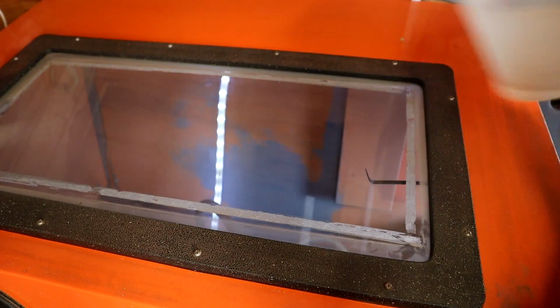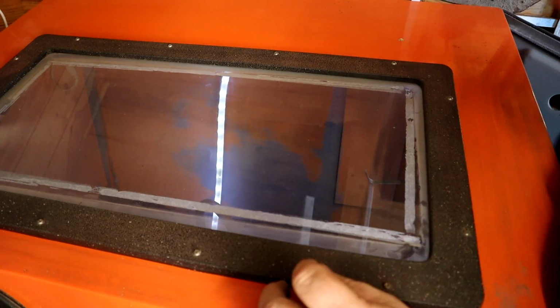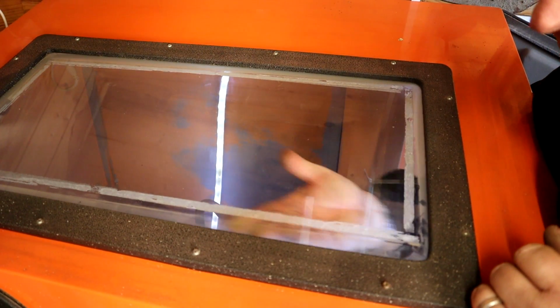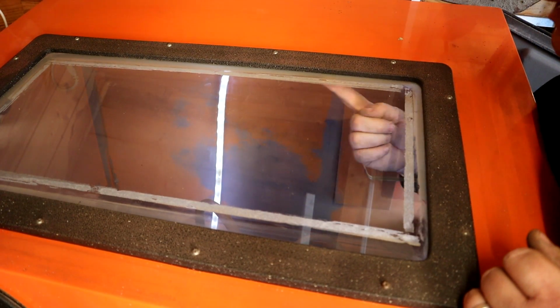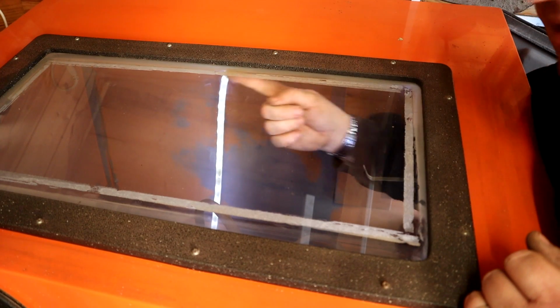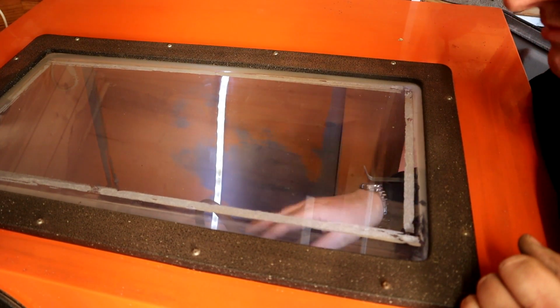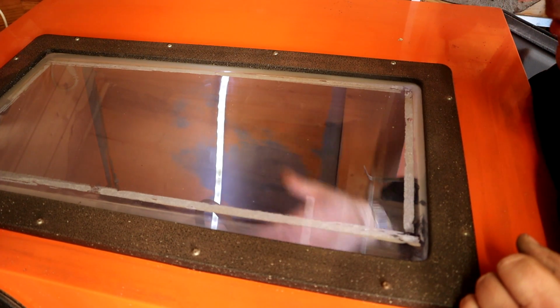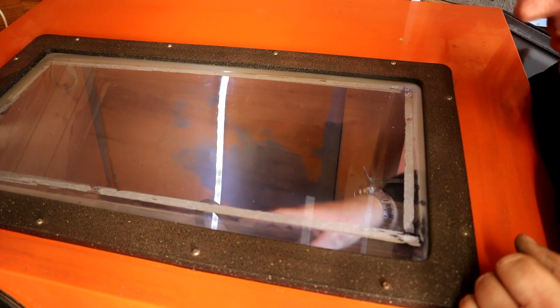But yeah, I made the mistake once of using it like this, and it sandblasted this in no time. As you can see around the edges there, look, it's a little bit discoloured. This is pretty new glass, as I say, but at the top there, look, that sandblasted it already. So always keep this area clean, and don't be tempted to sandblast with the protective films off. I've got another one indoors, I'll put that on in a minute. Probably not in this video.